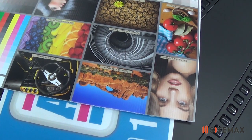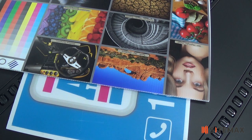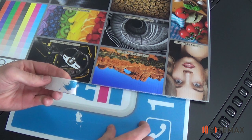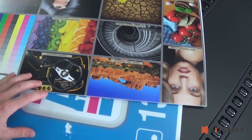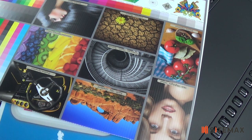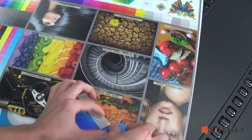There is a simple test that you can do to verify the difference in quality. It involves cutting a cross section in the material, then you apply some masking tape to that cut and peel it off. You can see the quality of the print — the ink has not even adhered to the core flute. Now we'll repeat that test on the latex ink. It is not peeling off. The ink has properly adhered to the core flute.